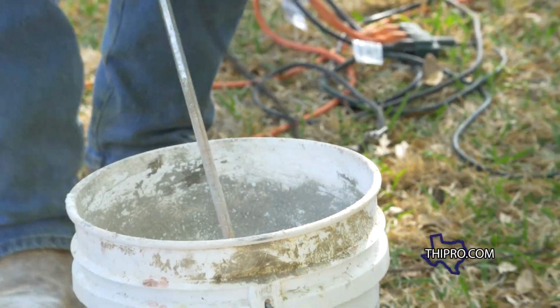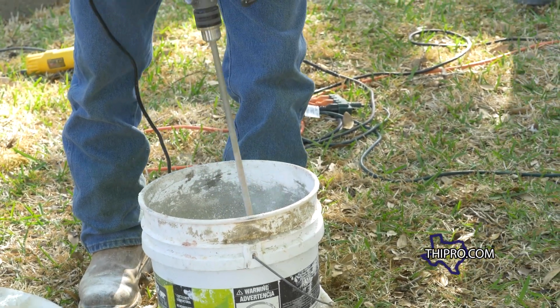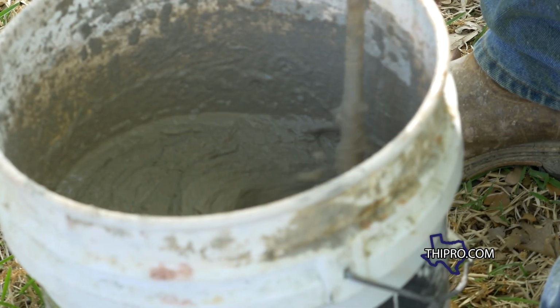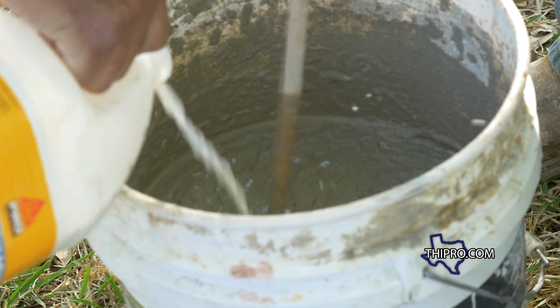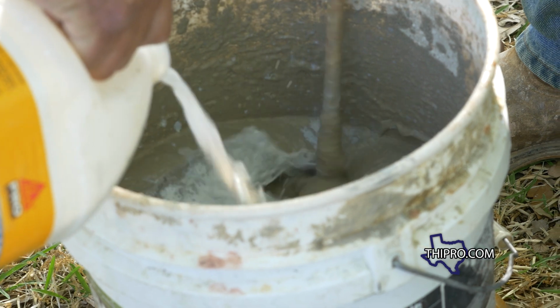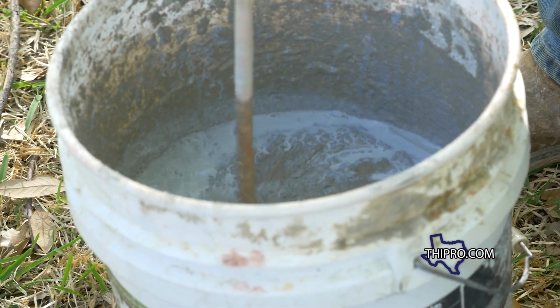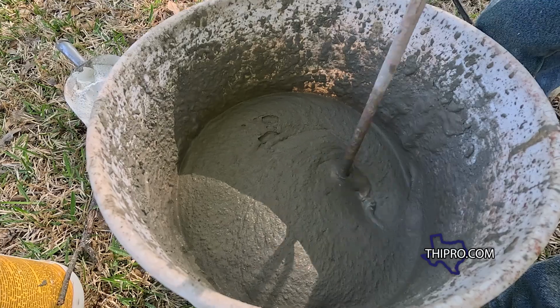He's gonna add some mortar dye to the mortar to be able to get that weathered look. And even on that, we're real specific of the amounts that we put in there, because our mortars aren't pre-mixed, where you just purchase it and add water to it. It's actual masonry cement and sand. So we're also controlling the strength of it by making the ratio of sand to cement less, so we're not adding so much sand to where it makes it weak.